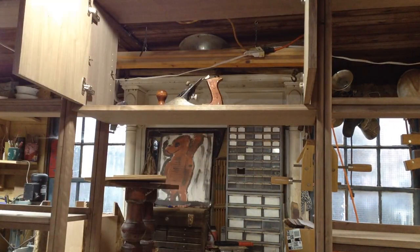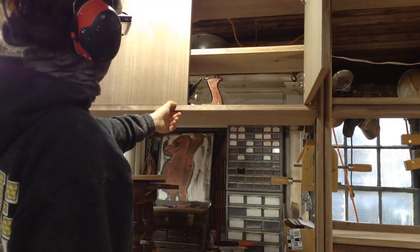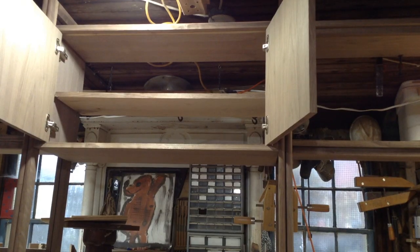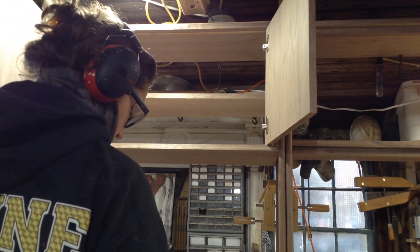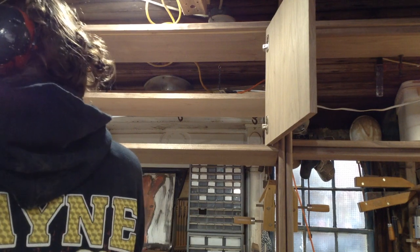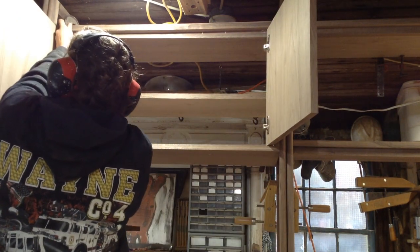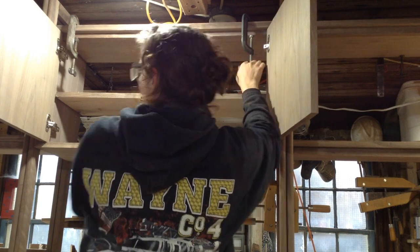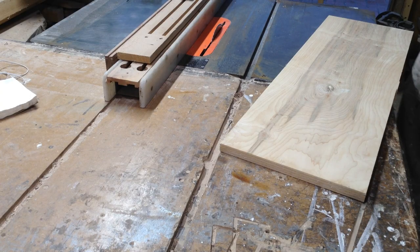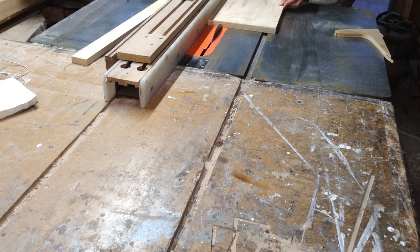At this point I was running out of walnut, so I decided to use maple veneer ply for the shelf. I stained it with a walnut stain so it matched a little bit better, then put walnut edge banding on the outside so you could barely tell it's a different species. It saved the customer a ton of money instead of ordering another full sheet of plywood just for a shelf. I then cut and mounted the inner rails - about 3/4 inch wide by about an inch deep - clamped those in place. This prevents the cabinet from bowing over time and acts as a door stop as well.